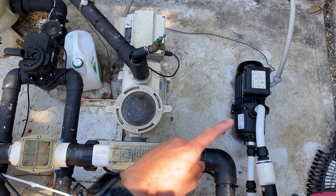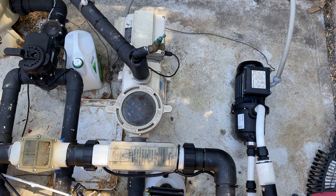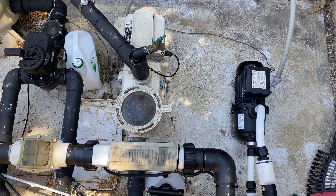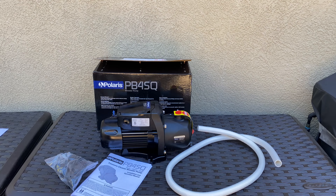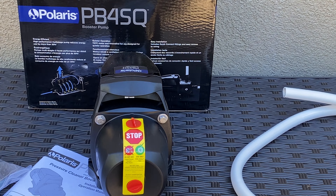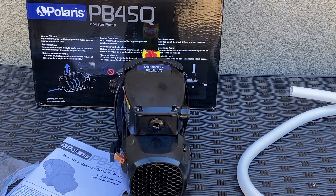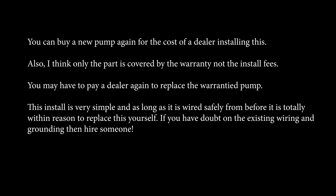Step one: you need to source a suitable replacement. Either replace it with the exact same pump because you know everything's going to fit, or choose one of several equivalent pumps which I'll put in the description below. There are pumps by Polaris, Pentair, and a few others — they range from about $300 to $500. They all come with adapters and a standard pipe size. I chose the new Polaris PB4SQ because it's both small and quiet. A lot of these pumps want you to have them installed by an authorized dealer, which will cost another $200 to $500, and with that you'll get the full warranty. Without authorized installation, the warranty can fall to something like 60 days or even less. It is a small risk if you do it yourself, but in the end you're going to save hundreds of dollars.